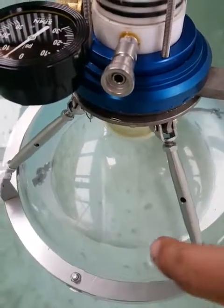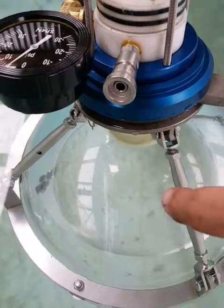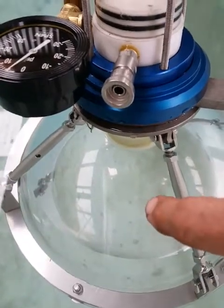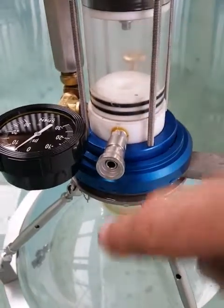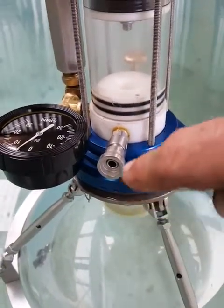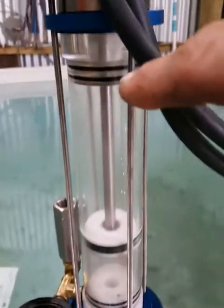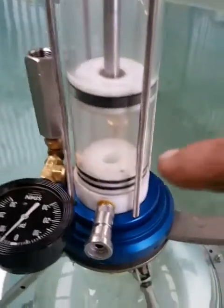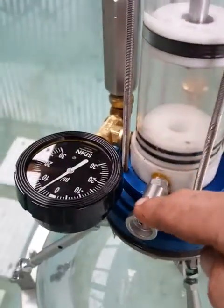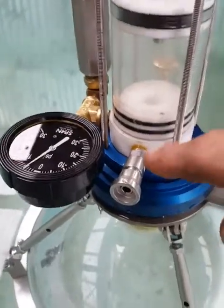In the test tank you can clearly see the gas bubble sitting in the funnel. As the syringe moves up, it draws in the gas or liquid. Once it's full, you can recover to the surface and discharge out of the QD into the sample bottle.